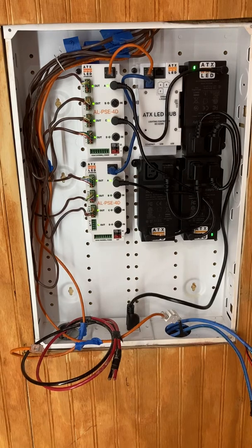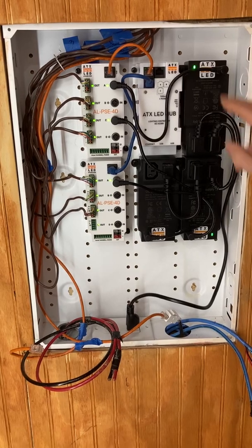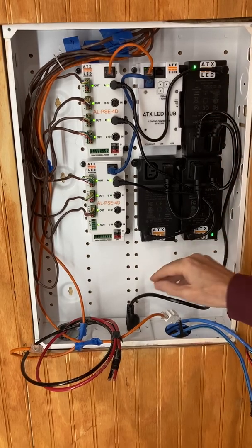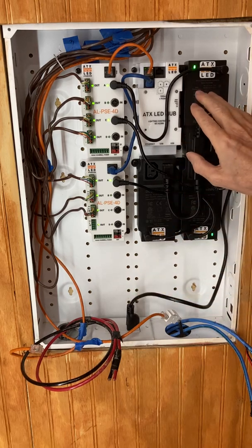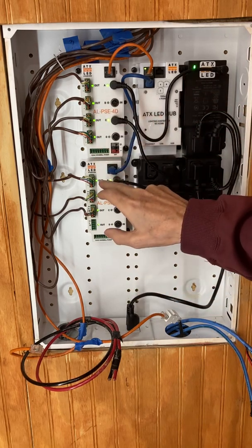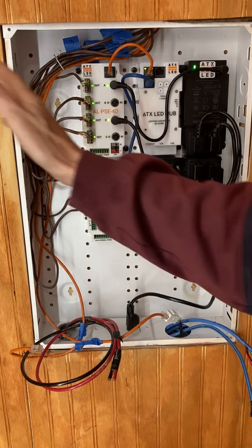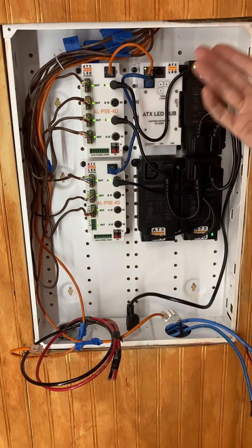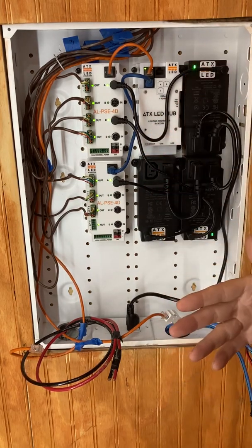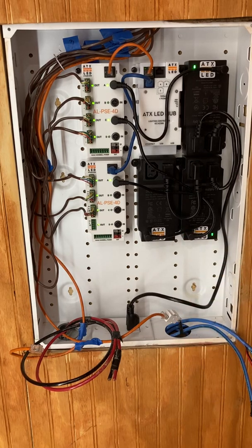Here's what it looks like in a real project. We have the power supply units that convert the 120 volt input into our DC. Here we have the distribution which goes out to the wall switches, and the wall switches then connect to the lights, and our smart hub which is optional. You don't need internet or cloud to operate the lighting in these houses.